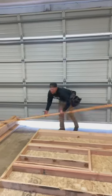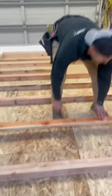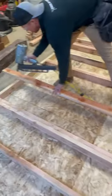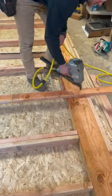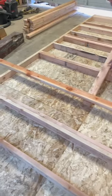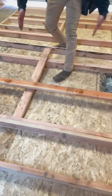You can use this when you need to move a wall, do a lot of different stuff. But what I'm going to do is take this, nail it to the bottom, nail it to the member I'm trying to move. Then I can take another piece of wood, shove it underneath it, lift up, and that's going to suck those together.